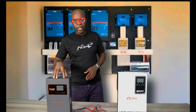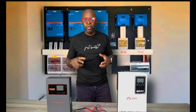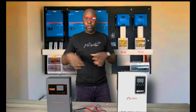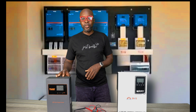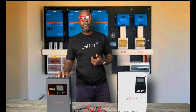For the low voltage charge controller, it's a totally different ball game. You're going to need a lot of wires to interconnect your solar panels in parallel because you'll need a lot of current to shore it up. There's going to be a lot of interconnections, and you'll most definitely have to use very big cables to size for the current that will be traveling in the wires.